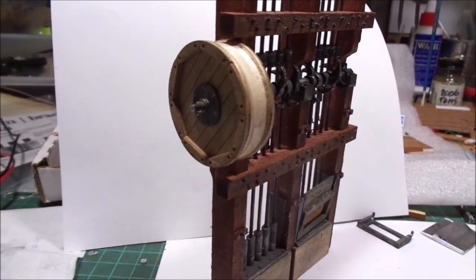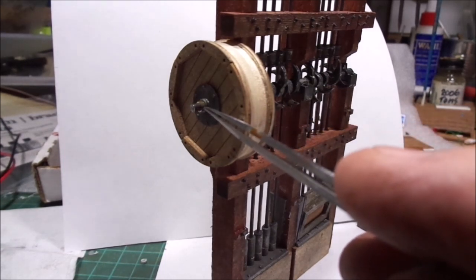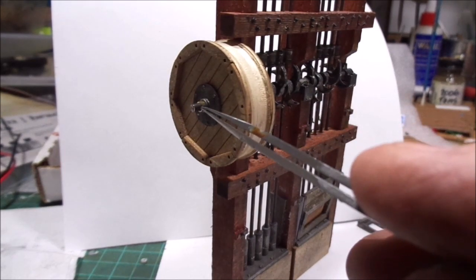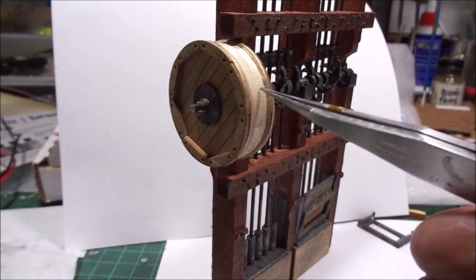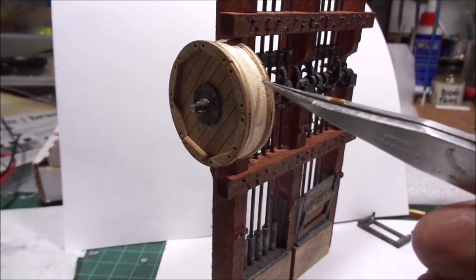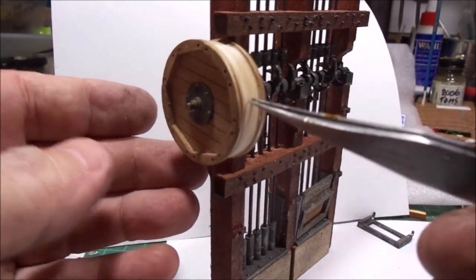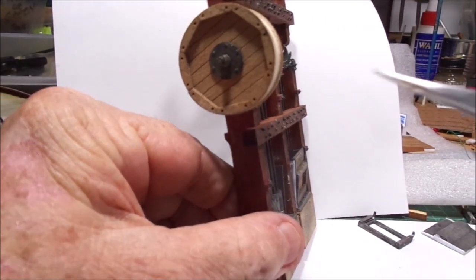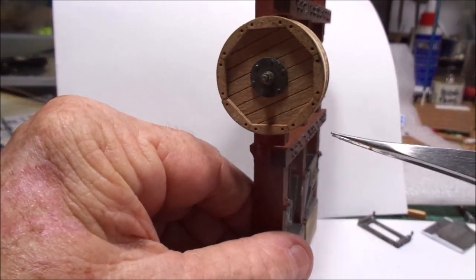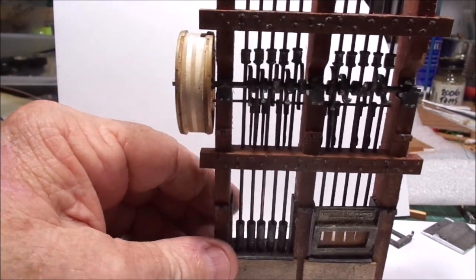The other thing that I've done is I've sleeved this out with a brass bush on there just to make the alignment better, and I've machined this part in here so I can get a belt drive onto it, so I've got a lip either side. That will turn. I've just got to put the nut, bolts and washers around there yet. So yeah, it's going to turn out quite nice.